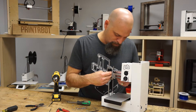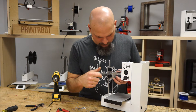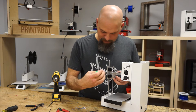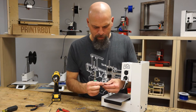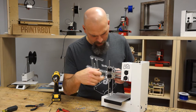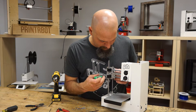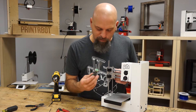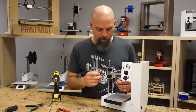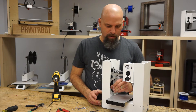So I can take my long screw, find the hole, and put this in. I bet you could do this without even taking the top off, but I wanted the camera to be able to see what's up. I'm not going to tighten that down super tight yet because I want to make sure I can get into the Plastite side. It's almost impossible to strip a Plastite because your screwdriver won't get enough purchase. I want it good and tight but not too tight. Belt's still good — everything seems to be aligned really well, so we'll put it back together. Working great.